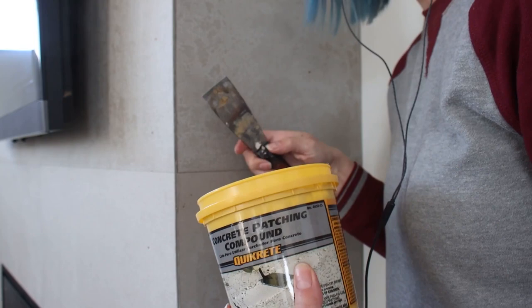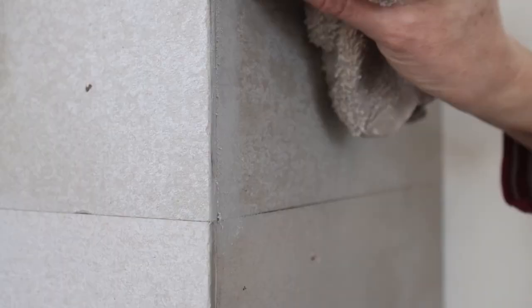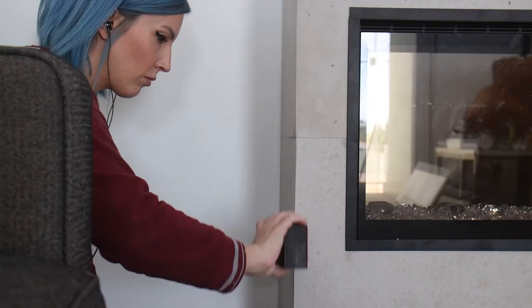The last thing was to handle the finishing touches with the concrete panels. We did a really good job with our seams, but because the framing and drywall will never be perfect, we had a couple of tiny little gaps to fill. I discovered that the natural gray color of our concrete panels perfectly matches standard off-the-shelf concrete patch that you can buy at Home Depot. I used my finger to rub a small amount of the concrete patch between the seams of each panel, and before it could dry I came back with a damp rag and wiped off the excess. When the concrete patch was fully dried, I used my Diablo hand sanding block to smooth over any rough spots.